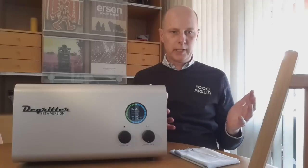And one of the things they chose to do was to increase the ultrasonic frequency. So it's now common to use 40 kHz, and I saw some do-it-yourself units at 80. This unit is working at 120 kHz. There's a rough division in the sense of 20 to 100 kHz, that's more your standard ultrasonic frequency. 100 to 250 is more high frequency and is more for medical applications. And if you go above 250 kHz, you go more into semiconductors and cleaning of substrates. They chose to do 120 and that also had some consequences.